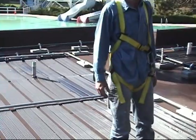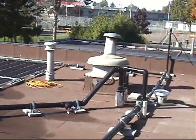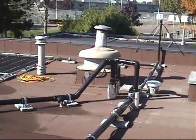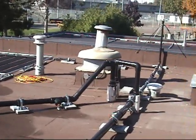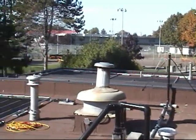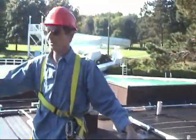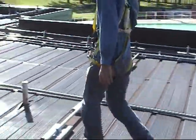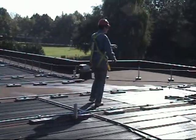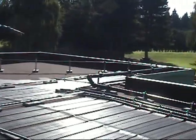What we have is four banks. The water comes up and down here from the pump room — that's three inch CPVC inside the pump room. One bank is over there on the lower roof in combination with this section, so there are three sub-banks in parallel that make up one bank. What we're standing on is bank two in parallel. This is where all the water comes together at the high point to return back through this three inch return pipe.